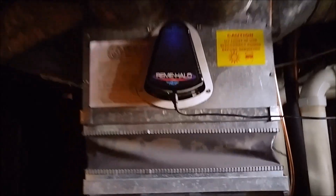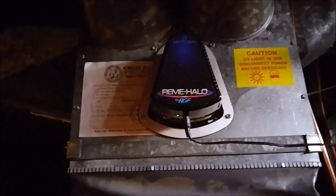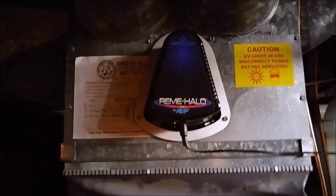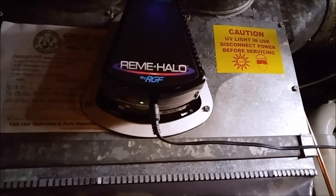You can actually smell it — yeah, that's it. Nothing to it installing these. This is a 24-volt model. I'm not sure if they still make a 110-volt model or if you just plug it in. But that's it for this one guys — just a simple RGF install. Something you should make your customers aware about for cold, flu, virus — it kind of helps prevent all those. And you put it above the coil, it prevents mold on the coil. Alright guys, like and subscribe, and I will see you on the next one.